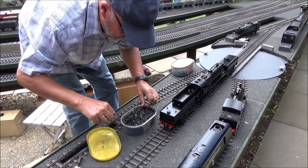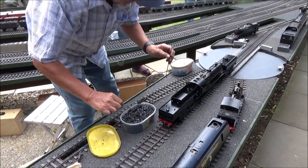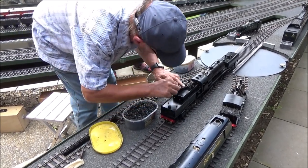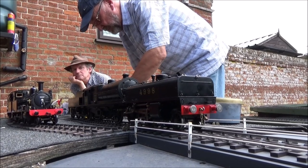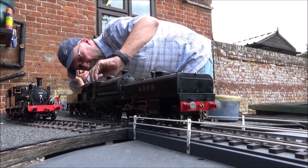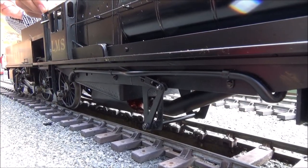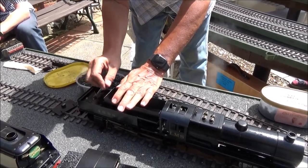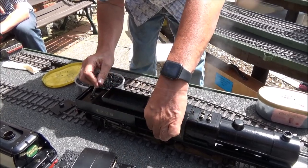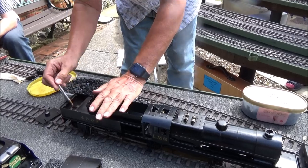Yeah. So, again, typically, once I've got going, I'll do a circuit and stop anyway, and then check and build up. Starting to get pretty healthy now. Now it's important to keep that water level up, because you need the water level above all the tubes to take advantage of all the heating surface.